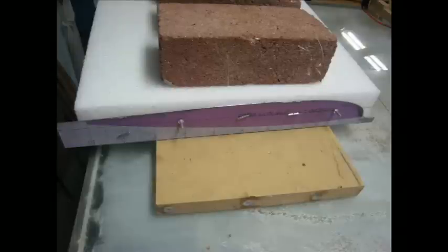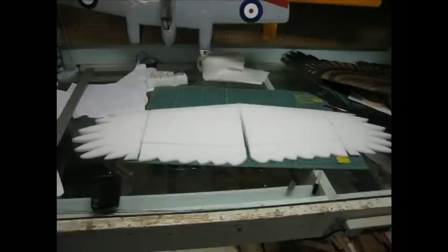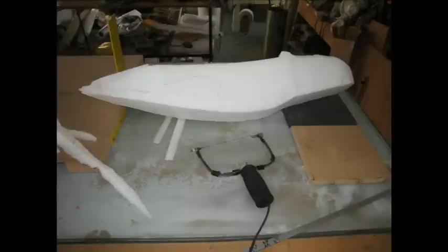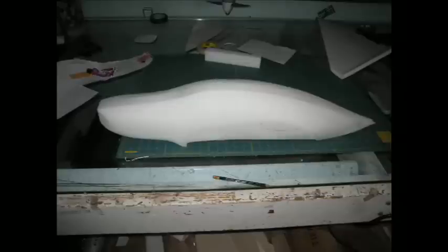The first thing one does in a design like this is to choose an airfoil. In this case, I chose an airfoil called a 23112-75. That's a plank wing airfoil, essentially a flying wing. The span of this plane is 8 foot and 1/4 inch, and it has a length of 45 inches.